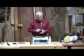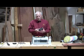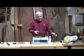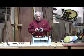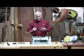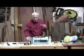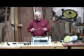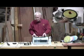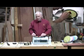We're set. We'll tighten these up so that the chisel doesn't move at all. At this point, we can remove the reference bar — there are two little screws on the side; take the reference bar off. There's a roller and a stainless steel tube here; we're going to remove those. They just snap out. Install that on the bar that comes with the Lap Sharp, put the pins in to hold it in place, and we're ready to go.